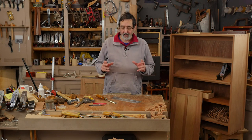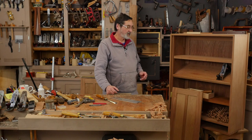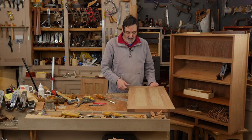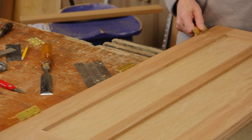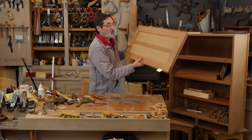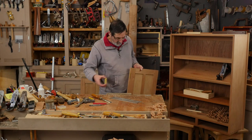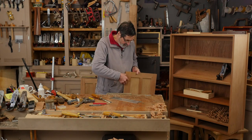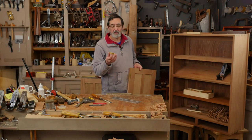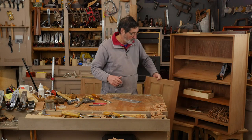We're ready to take that next step and hang the door onto the stile — this is an important step. I've got all my hinges set exactly the same way I did the first one. My door is not twisted and fits into the recess just about right. I picked another hinge that goes the same height as two of the three hinges — one is slightly less — but I'm going to use the same hinge to map out the hinges on here, so it's worth having a fourth hinge.